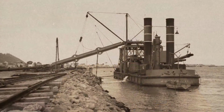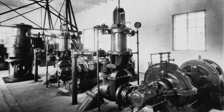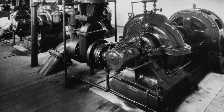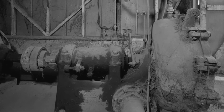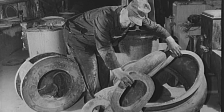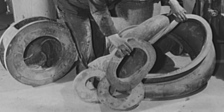The pumps being used in phosphates were traditionally a conventional dredge pump design. Most of the pumps were a standard 3-vane design with semicircular volute profiles, typical of some of the older designs that have been around since before World War II. In those days, manufacturing technology wasn't advanced far enough yet to allow the production of complex shapes as far as castings are concerned, molding and what have you. So the ultimate end product was always a compromise.